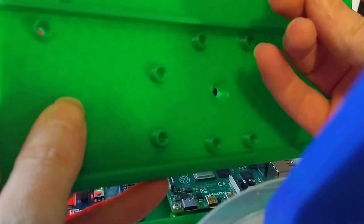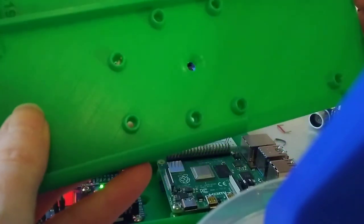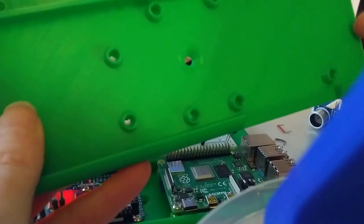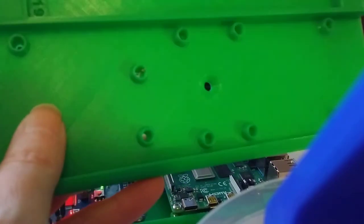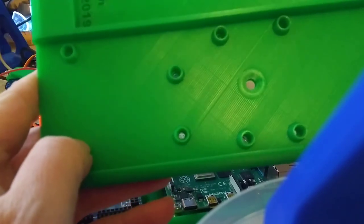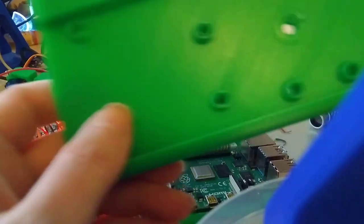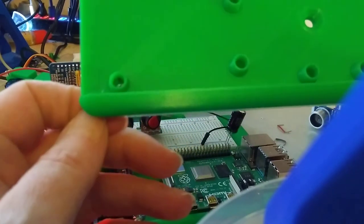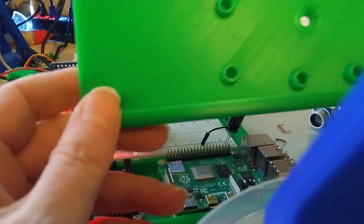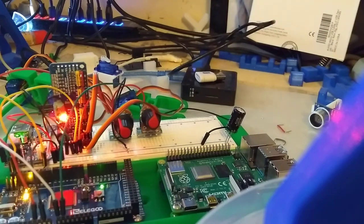These are really useful generally. If you ever want to thread into plastic, get yourself a bag of 3mm brass inserts — it's probably the best size. I find 3mm suits most things like the holes in circuit boards, and it's strong enough for structurally building stuff. If you're soldering already, you've got all the tools you need to insert these into a PLA print. Typical soldering iron temperatures of around 300 to 350 degrees centigrade are more than enough to push them into the plastic. I hope you like that, and thanks very much for watching.